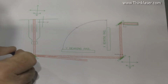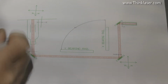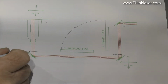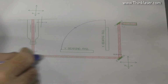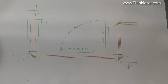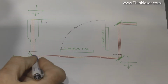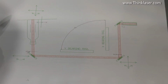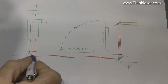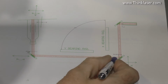What we've got to do is adjust this mirror here. Let's see what happens when we adjust this mirror. Fine, look, we can put 2.5 degrees of rotation on this mirror, and we can make that beam run parallel here again. Brilliant. So we've got a degree of freedom here, and we have got some ability to fix the problem that's caused by misaligning a plan view of the laser tube. And we're back on plan again. So now this is running parallel.